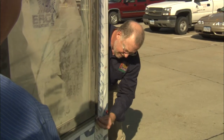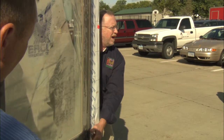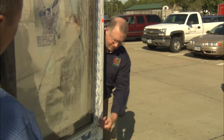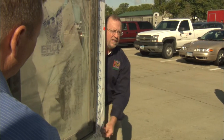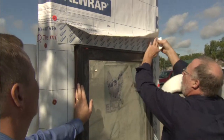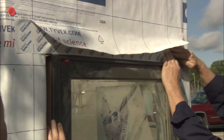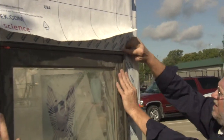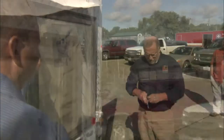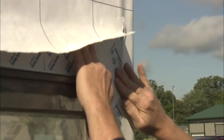If you go over a little bit, you can mold this corner a little bit better so that it seals that corner out. Sometimes you're not going to be able to get it good enough, so run another little piece of tape across that — because this is where our big issues are. You'll want to go over the sides, go all the way across the top, seal that nail flange down tight, and make sure this corner is sealed. It doesn't hurt to put another piece of tape right there; cut a small scrap and force it around that corner.